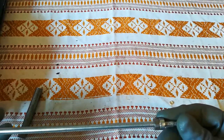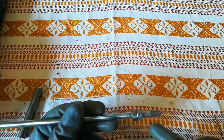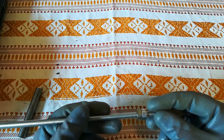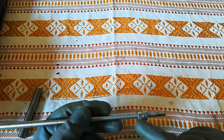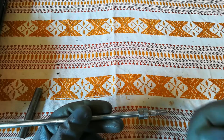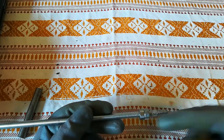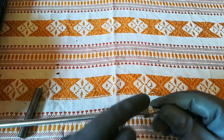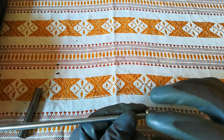Here on this end I made a little triangle so that I can clamp it with my drill. I also have these two nuts so I can use the wrench and turn it slowly if I need to. These are counter-tightened nuts — one goes in one direction, the other goes in the other direction, and then they lock together.